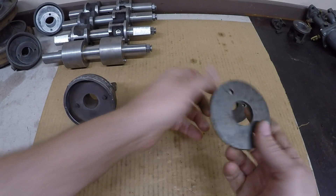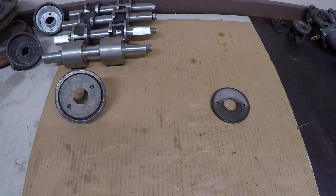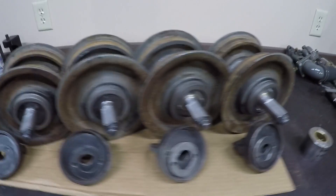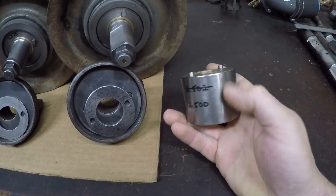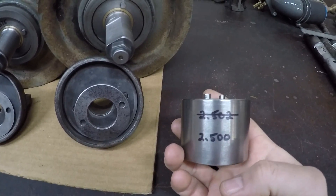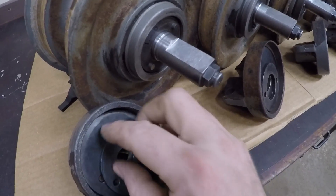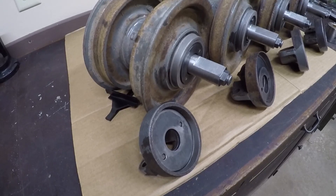The excessively worn thrust washer — I was able to find a few new ones of those, so that was an easy problem to resolve. The next day I've got all the bushings pressed in, all the roller shafts installed and in play. One clarification: the full-diameter sleeves I turned to replace the collapsed bearings — I initially stated 2.502 outer diameter, but upon trying to press them in I realized that was too big. I took them down to an even 2.500 and they were an excellent fit. To set the side-to-side clearance on the rollers I had to be mindful of how deep I pressed in each bushing, since the bushings dictate the final position of the thrust washer relative to the bearing cap.